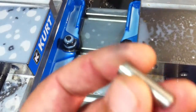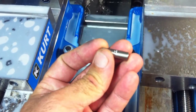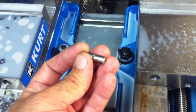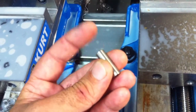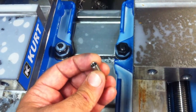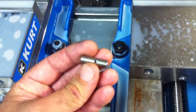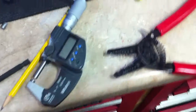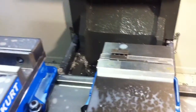What I'm actually doing right now is putting in that counterbore right there — it's threaded and it's a specific distance from this end, which also has a counterbore. I've already done that and unfortunately didn't shoot any video of it. Inside of this hole we're doing now, the ball mechanism will screw in to actually make the bolt action work. So here I am running it with no coolant.